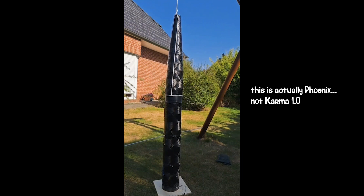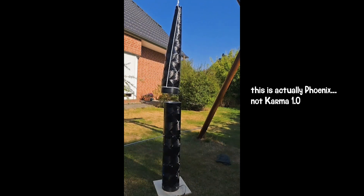Having reasoning out of the way, let's talk about how it was before we changed it. Karma 1.0 was a fully separating rocket. It employed a design where, once the rocket reached its maximum altitude, the nose cone would be fully separated from the booster, leaving two separate parts to fall — or, well, glide — back to the ground. The important part here is that we were really only planning to recover the nose cone with a parachute, having it glide back down, whereas the booster would just drop back to the ground. That was until we learned about the UROC requirements.